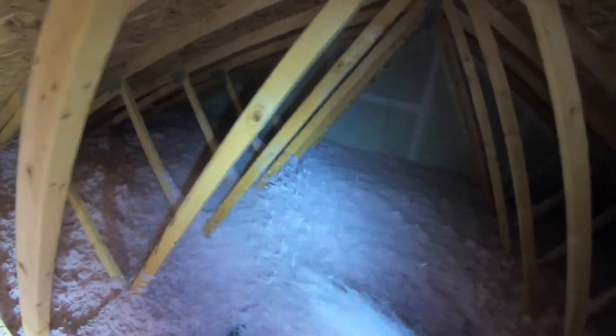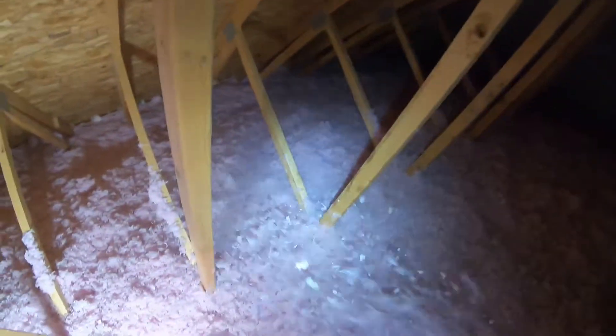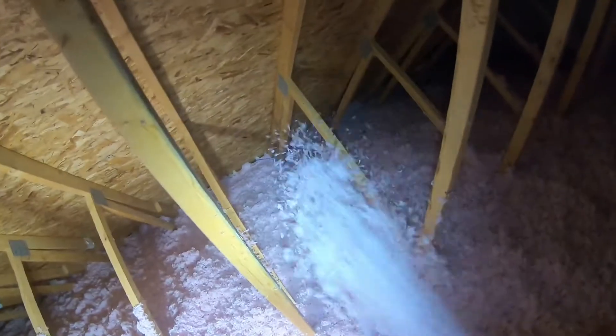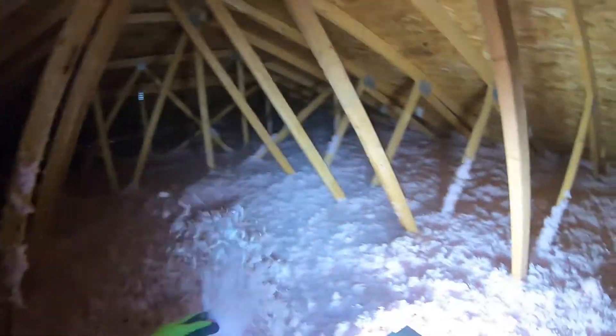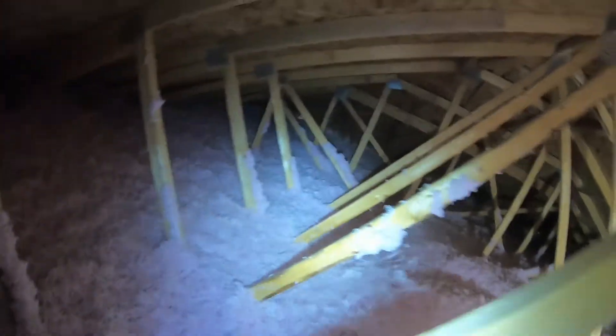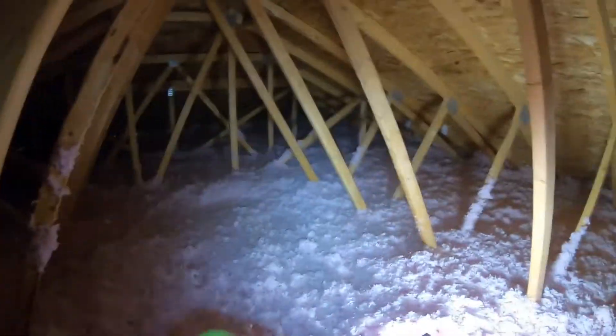This is where you do your cupping, typically — by that I mean you put your hand over it. That's just to cover right on the edge of the attic hatch, like so. You still want to try to work your distance so you're not crushing the material; it's getting a nice spread. Finishing touches there. The best way to see if it's all even is to look through your trusses and see that it's all even.